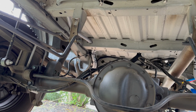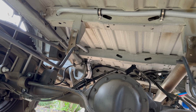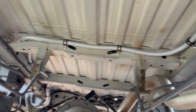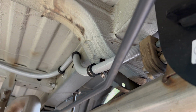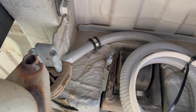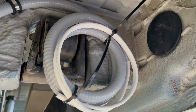For the rear external outlet, I follow the other 2 lines out of the driver's side boot, but instead of crossing the frame member, I go through it and towards the rear of the van. I have one more anchor point before going through the next frame member and crossing along that one to the passenger's side. I keep things tucked along the main frame, being sure to stay out of the spare tire basket envelope, and continue over the tailpipe and temporarily terminate here.